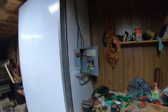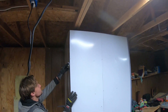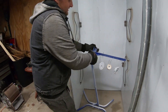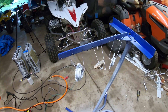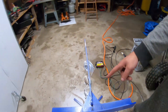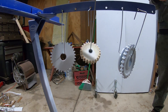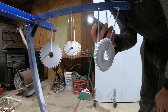It's been fifteen minutes. You ready to pull it out? Almost. Got your gloves? You're ready — kill the heat. Let's see if this ridiculously huge powder coating oven handled our small gears. Oof! Well, that's not good, but okay. Not good at all — there'll be a bit of oil in that one. That one had a lot every single time we took it out. So we'll learn something here today: clean your parts — real f***in' well. I think they all had some oil left in them, on the inside. None of them were great. They're not bad on the flat front — the easiest part to clean. Even with the oil coming through, I call this a success. Yeah, this isn't terrible. And it's a proof of concept — the other two aren't bad at all.